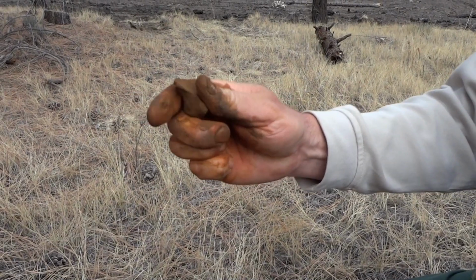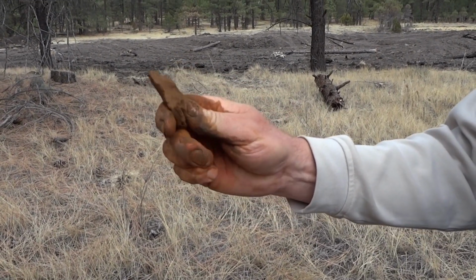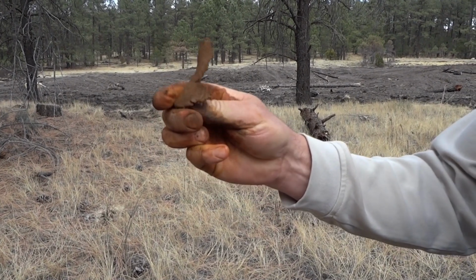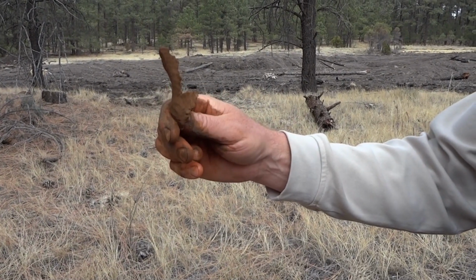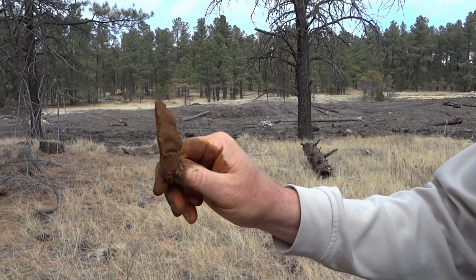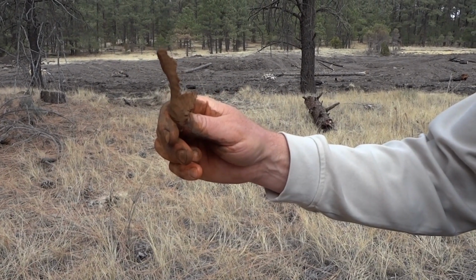The soil used to line the wetland basin must contain at least 38% clay. This means that you must consistently be able to make thin ribbons of soil that are at least 2 inches long. The high clay content is important because it's not possible to compact soil that has a lower percentage of clay, which means that if you build the wetland using sandy loam or silt loam, the wetland will leak and it will fail to hold water as planned.